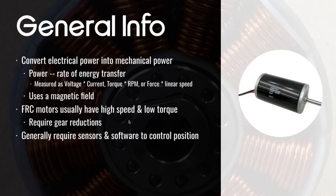What you have to know for right now is voltage is basically how fast electricity is moving, and current is measuring how much electricity is moving — that's a very oversimplified model. Power is also measured as torque times RPM for rotational motion, or force times linear speed for linear motion. It's basically the rate at which you are transferring energy from one thing to another.